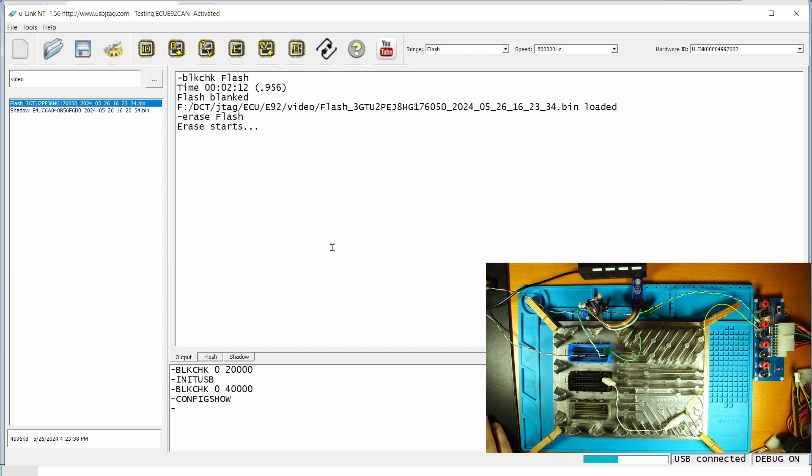So it's always a good idea to read the shadow and the flash first so you have a good backup. Just in case you do get a brick, then we have a way to recover it. But you need to open this case, which is very hard to do, so be very careful when programming. Since I already have the other side off, I'm going to demonstrate the boot assist mode in the next video and JTAG in another video.